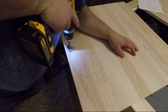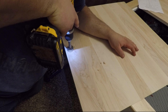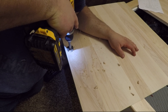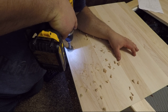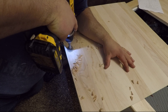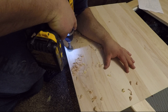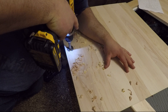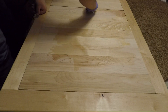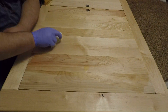With the two square pieces down it's really hard to lift them up, so I need to cut some holes so you can get your fingers in and pull them out. One of the last steps is cutting these holes with a Forstner bit so that you can get your fingers in and pull the pieces of wood out from the center. After that I just seal it up with a couple of coats of polyurethane finish and then we're done.